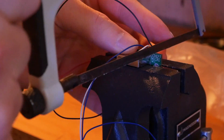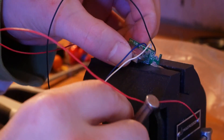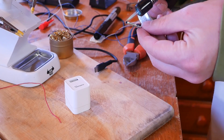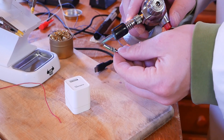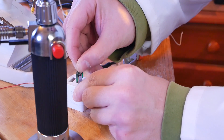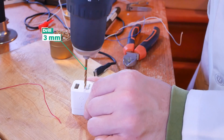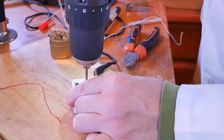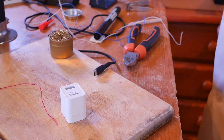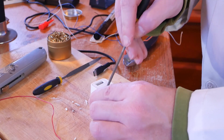The easiest way was to remove a bit of the PCB. Where the label says Sonoff Micro, there are no traces and you can cut that bit off, creating a slot for the cables. I would have used a female USB adapter heated up to burn through the hole, but instead I reheated the socket slightly just to mark the imprint, then used a drill with a 3mm drill bit. In hindsight, I should have moved the socket slightly toward the top of the board to create more space. It was still a bit tight, so I used a small file to finish off the job.